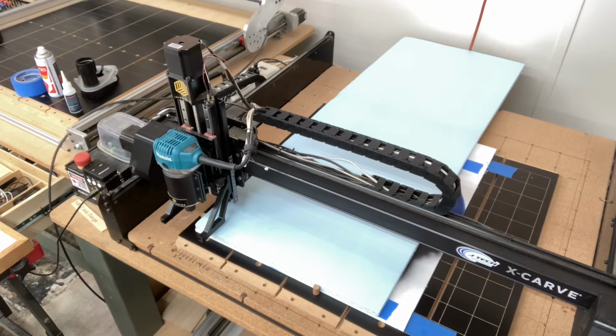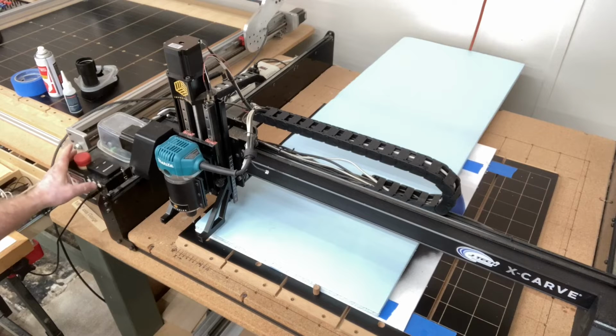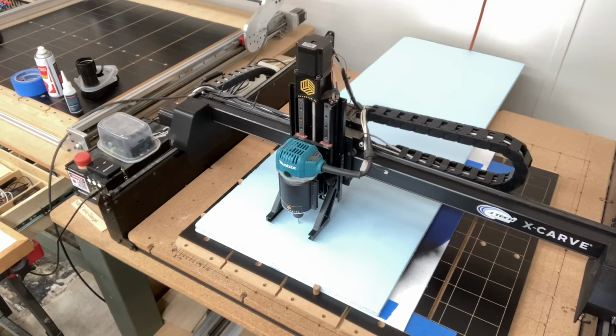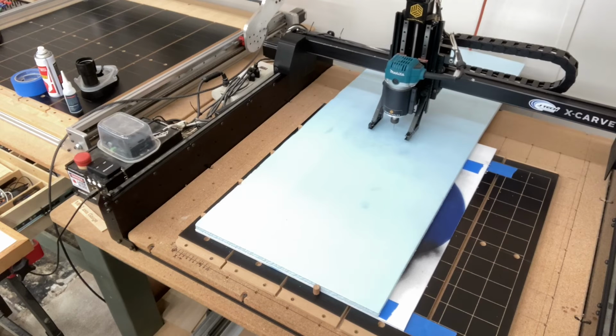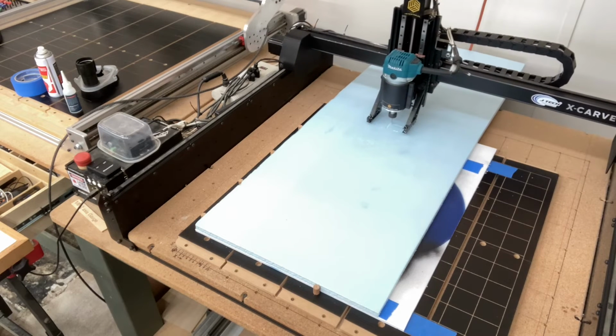The one thing that I did not record on camera was the actual speed settings. I set the machine to cut 100 inches per minute using 1 pass. As far as the cutout itself, I did that in 3 passes. And that made it where the carving only took about 12-13 minutes to do all of the cutting.